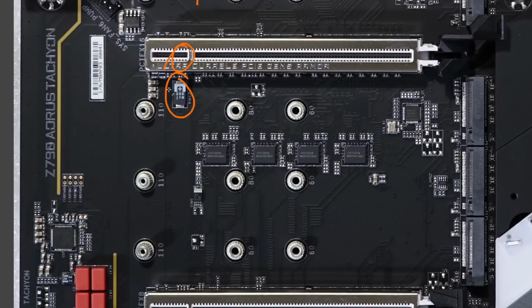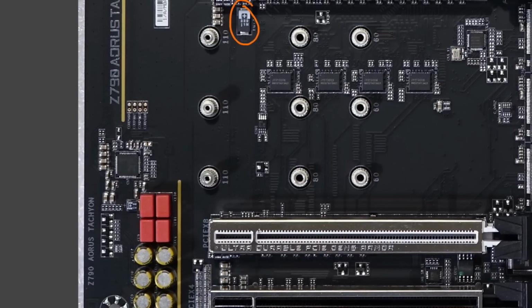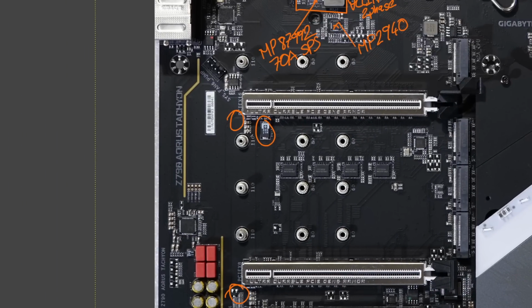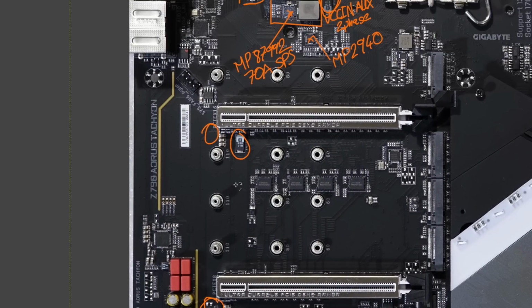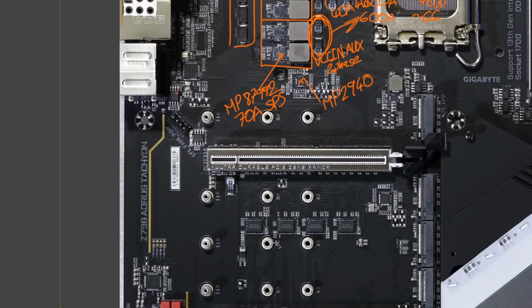Yeah, so that one isn't for the 12 volt side of the PCIe slot. Actually, it's pretty typical on most motherboards to see a through-hole polymer for 12 volt filtering right at the PCIe slot. This board's not doing that. Not that it should affect anything, because your GPU will generally not pull that much power from the PCIe slot